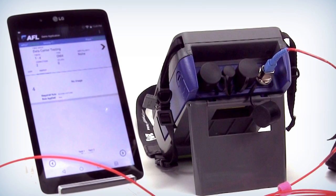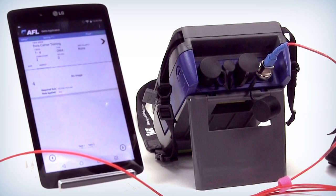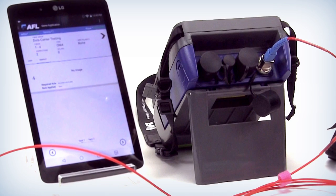So in this case, we want to take our test reference grade jumpers of OM4 — we're going to inspect them, we want to clean them, and plug them into engine one, which again is on the left-hand side. And we want to do that in both units.